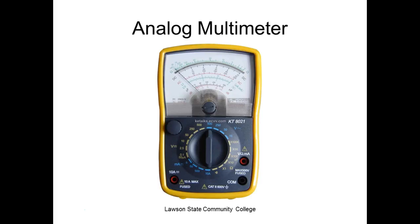Okay. This is an analog meter. Analog meters are still available. You can buy them. We don't use them that much anymore. The problem is your analog meter doesn't use a linear scale on your ohms. These scales down in here, these are linear, but you got a different scale that you use depending on what you're measuring. So if I was measuring DC, I would use this scale, and then the scale changes according to what range you have selected.